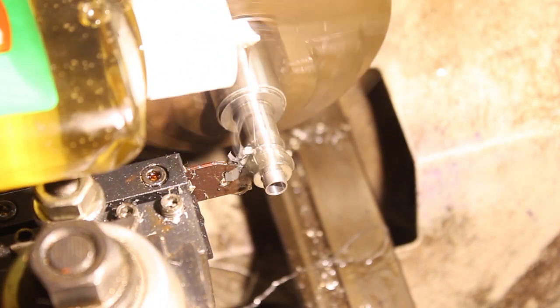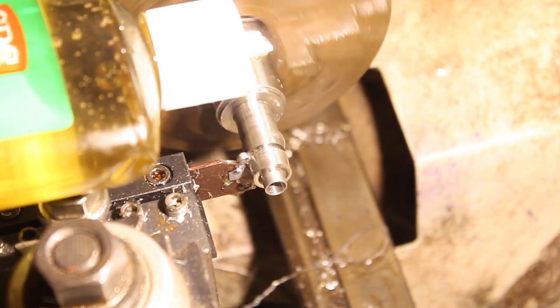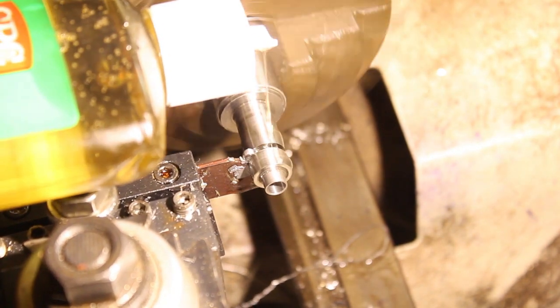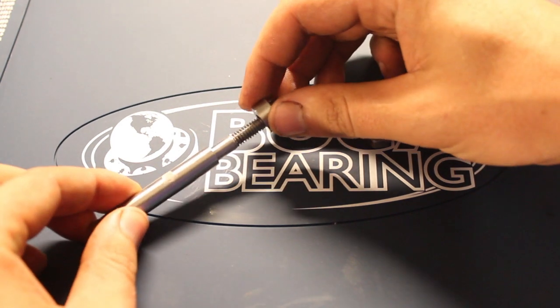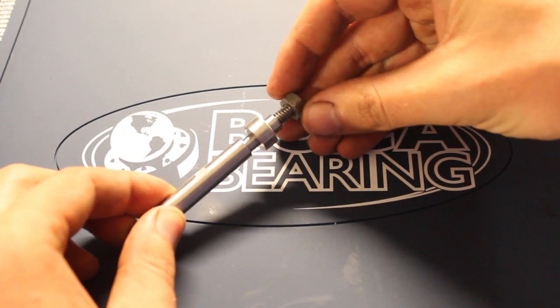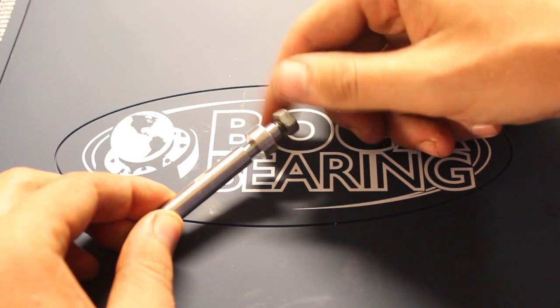After this part was done, I probably could have bored that hole just a little cleaner. With these two parts complete, I pressed the gear blank onto the arbor and used a nut to help run it down into place. This proved to provide a very strong bond for the milling operation.